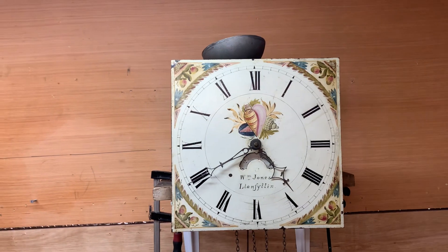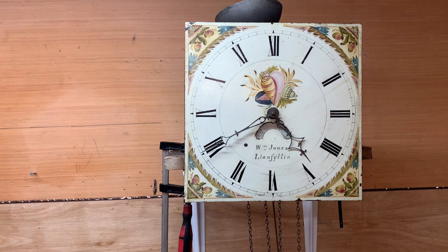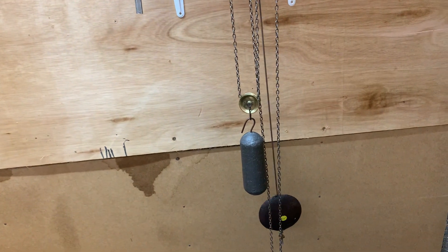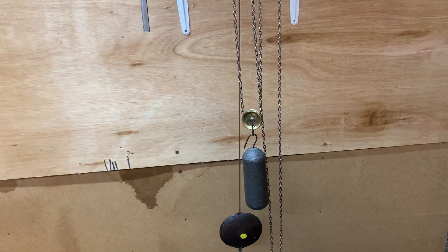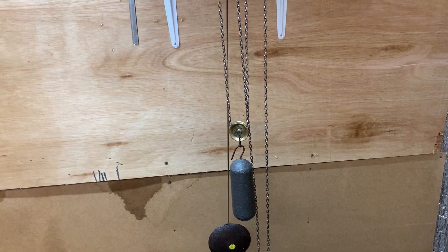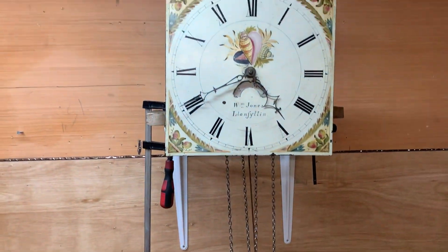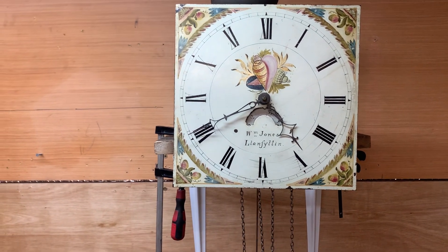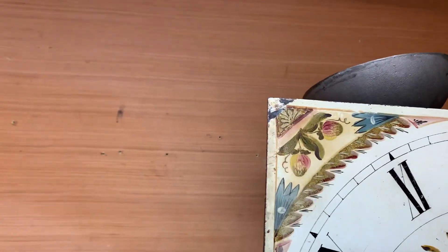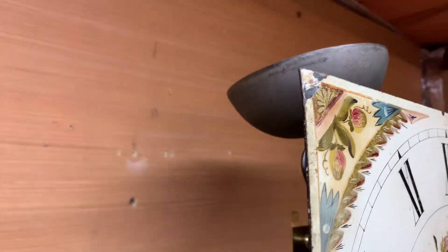This is a 30-hour grandfather clock and I'd probably date it around about 1750–1760. If you go down you can see it's a single weight driven clock, and the weight is quite a small type weight — obviously it's pendulum driven. It was only repaired this week so it's been put on test. There was quite a lot wrong with it really. At some point in its life we believe it's been dropped, and if you look to this corner you can actually see a little bit of damage — it's actually slightly curled over.